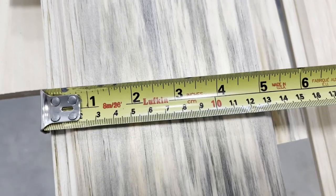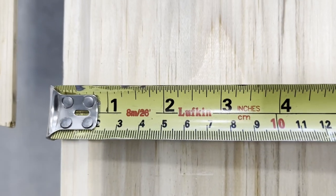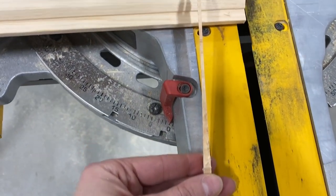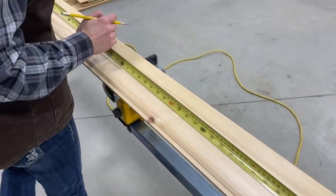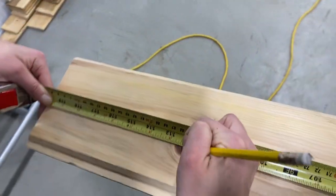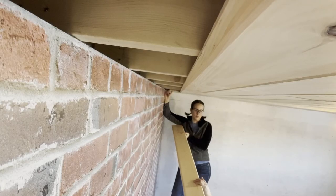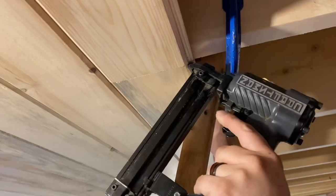The widths of our boards ranged from five to five and a quarter inches. The first thing we did is measure and make sure that every board going into a single row is the same width. From there, we would square off our ends by cutting off a tiny slice, then measure to the length we need. Once the boards were cut to length, it's ready to install. We would nail into the tongue and groove seam at roughly a 45 degree angle at every joist.